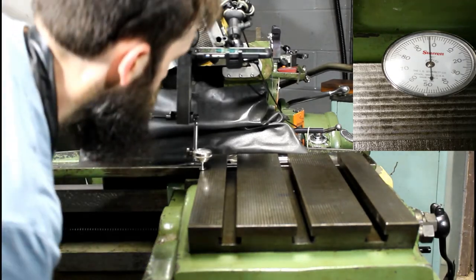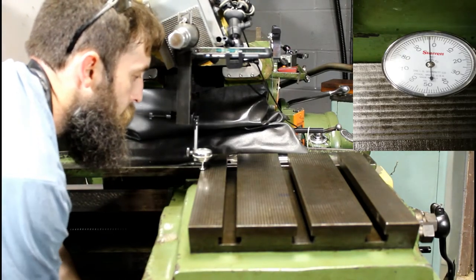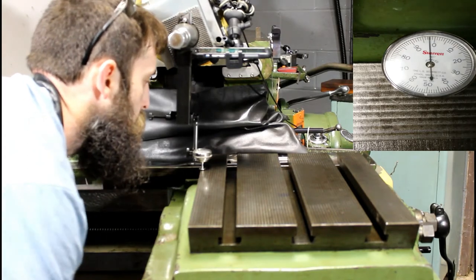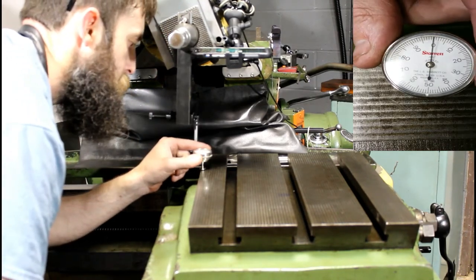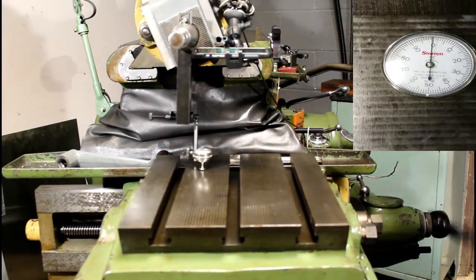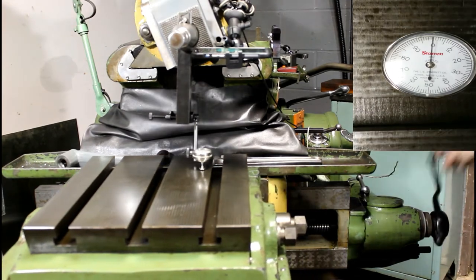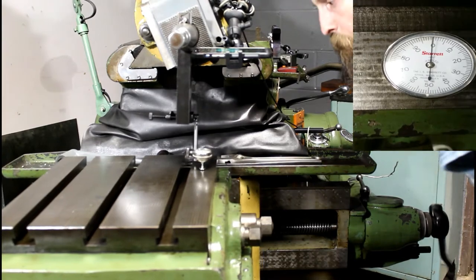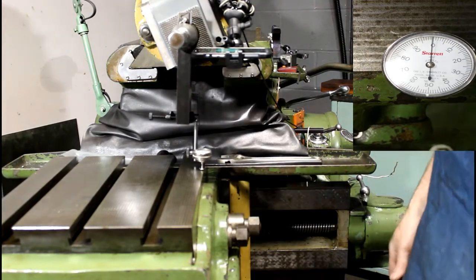So what are we off? About a hair over two — hair over two low. So we want to go a hair over one. Raise this side. Rinse and repeat basically until you get zero — a constant zero reading between one side and the other. But you definitely want, after you tighten the bolts, you want to recheck, because tightening the bolts can change your reading. We're at about two and a half tenths — I think that's good enough.